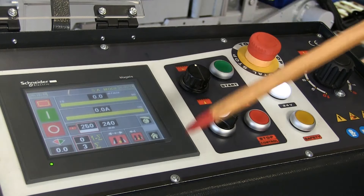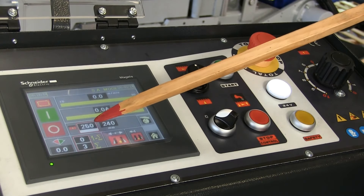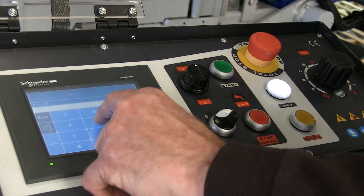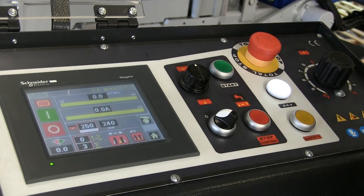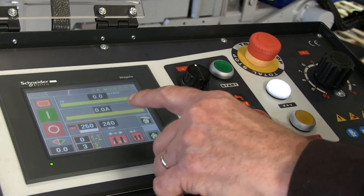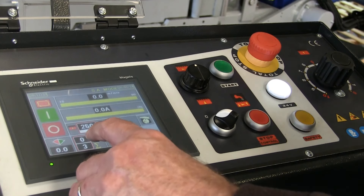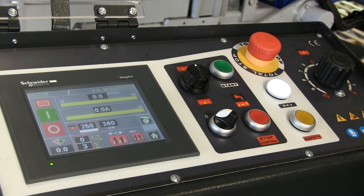The control panel here — you can see this is the height setting. Basically, if you want the machine to come up just above your workpiece, supposing your workpiece is 250mm, you then set this to 250mm by just keying in here. At the moment the machine is at 240mm because that's where it came to rest last time. Over here is a simple piece counter — that means if somebody distracts you while you're cutting material, at least you know how many you've done.